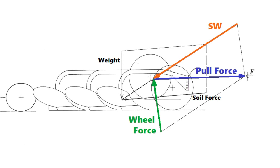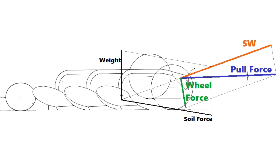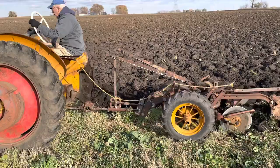Now let's look at an improper vertical hitch adjustment — specifically a hitch that is too flat, which is common at plow days. Raising the plow drawbar is usually motivated by something riding the plow out of the ground, such as worn shares with a sled runner or brand new shares that are too blunt. As the line of pull becomes flatter, the wheel force location shifts forward. Once it reaches the front wheels there is no vertical force on the tail wheel, and when it shifts in front of the wheels you're actually pulling up on the back of the plow. As soil force changes through the field, vector SW orientation changes, making the wheel force shift wildly forward and back — causing the back of the plow to bob up and down and making consistent plowing depth impossible.